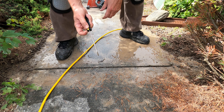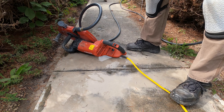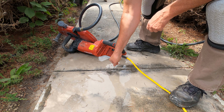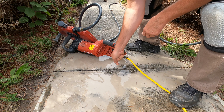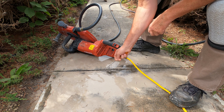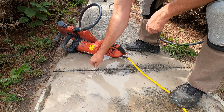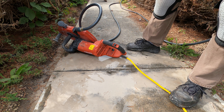The blade is going all the way through right into the dirt below, so I know I made it all the way through the concrete. The thickness of this concrete walk is anywhere from probably three and a half inches to over four inches in some spots — it's very thick. I still don't think it's all the way through in places. I'm hitting a hard bottom; I've got to set the saw to cut deeper.